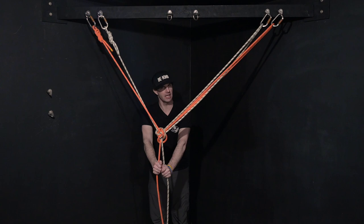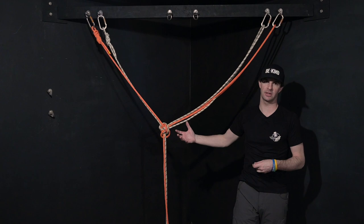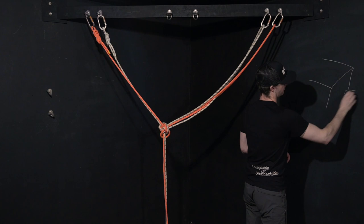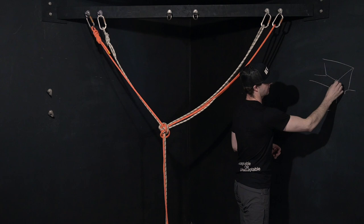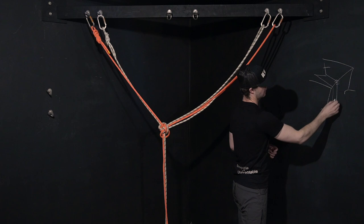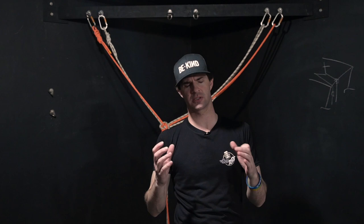Now where this is very important — yes, it's important in the vertical when you're rigging up like this, but say that you are on a roof and you have to rig your Y-hang and go over the edges. We're all familiar with window washing and building maintenance. If you have your rope protection here and one line fails, this rope is going to come here and then down, your rope protection is going to be down somewhere, and that rope is going to run all along that edge — extremely, extremely dangerous. You have rope protection there for a reason; you don't want the thing to move.